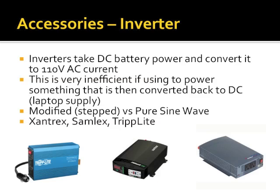Moving on to inverters. An inverter takes DC power, 12 volts, kicks it up to 110 volts AC, again through science and magic. Primarily two types. You will hear them called modified sine waves, and if you look at it, it is a filthy square wave. And by filthy square wave, I mean most of them only have 3 points, plus 100 and whatever the peak-to-peak voltages of AC, 130 whatever, 140 whatever, 0 for a period, and then all the way to the bottom.